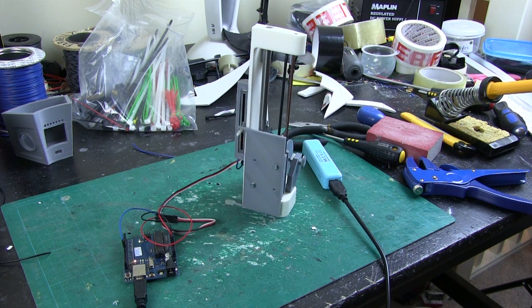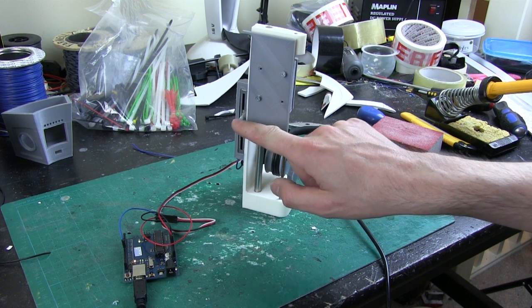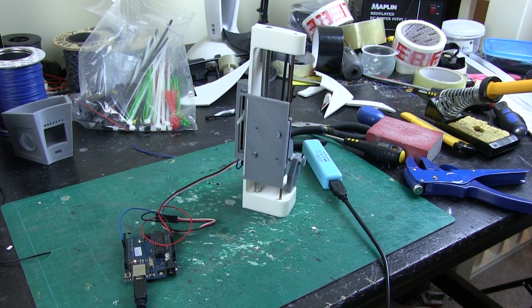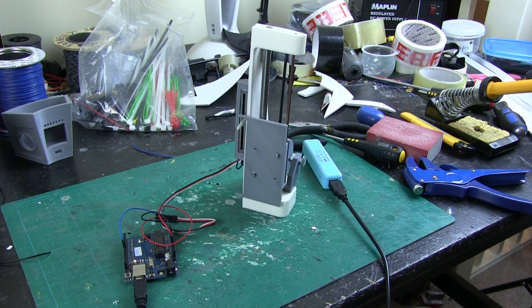There's a bit of tension in the NinjaFlex at the end which is why it's struggling to go up, then after a short delay it goes down - and it kind of goes down and up and down again, and I'm not sure why, because basically that's just sending servo positions. Something curious is happening because the wiper isn't attached to the carriage as it would be expecting. Actually it's quite a nice feature - it looks like it's not quite sure and then finally puts it down, which would be good for the periscope effect. I just need to sort out that string tension, but overall it works.